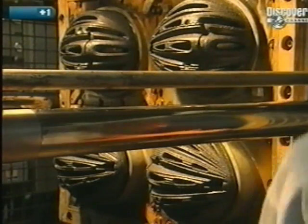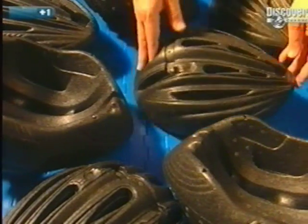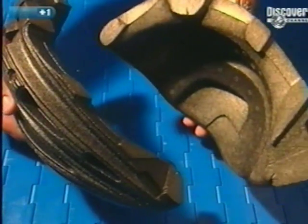The press closes up for six minutes. The particles are steam-fused before being cooled with water. The foam is then removed from the mould. Different designs are produced for different helmets.